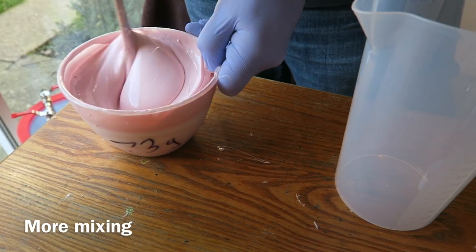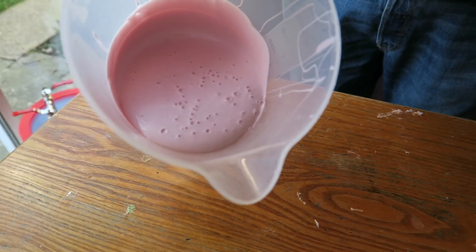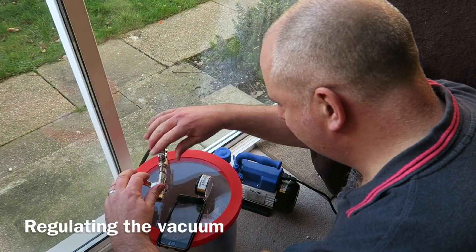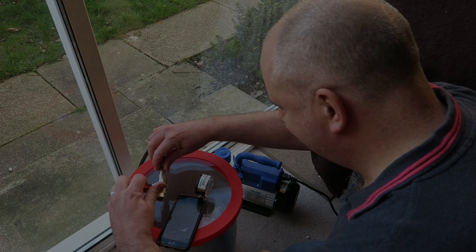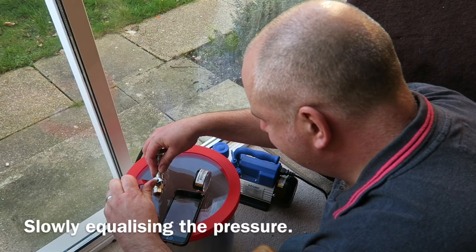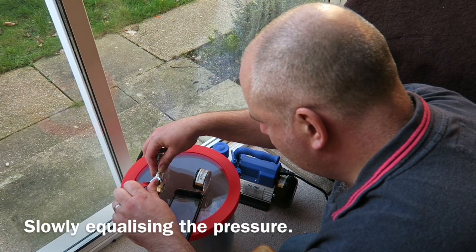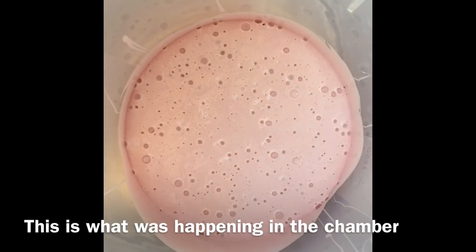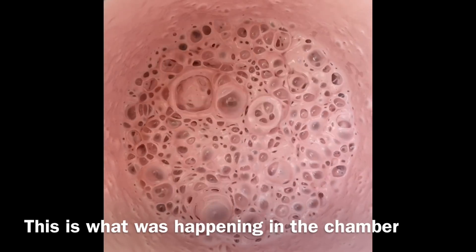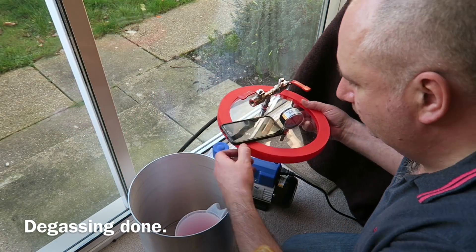You've got quite a long working time with this stuff. I'm pouring it into a tall plastic jug and mixing it a bit more. You can see there's lots of air in it. Here I'm switching on the vacuum pump with the tall jug inside the vacuum chamber. I moderate the pressure a little so it doesn't rise up and overflow the sides - tall jugs are very useful for this. It's all done after a few minutes and I gently release the vacuum. You can see in the speeded up view it all bubbles up and rises right up, then the bubbles pop and it sinks back down. I left it a moment longer to finish degassing, then released the pressure and took it out.